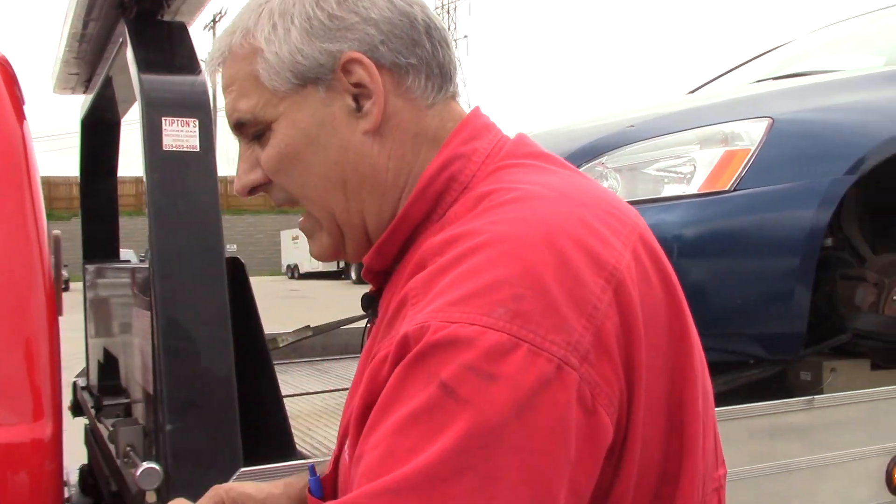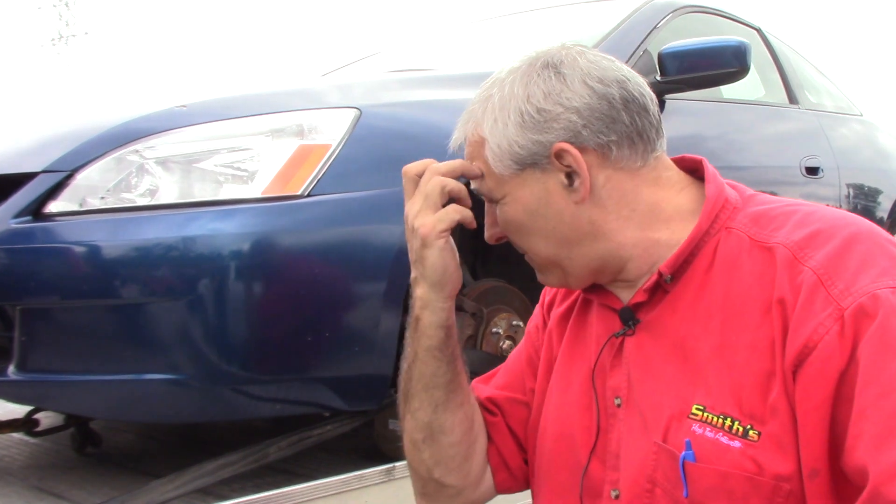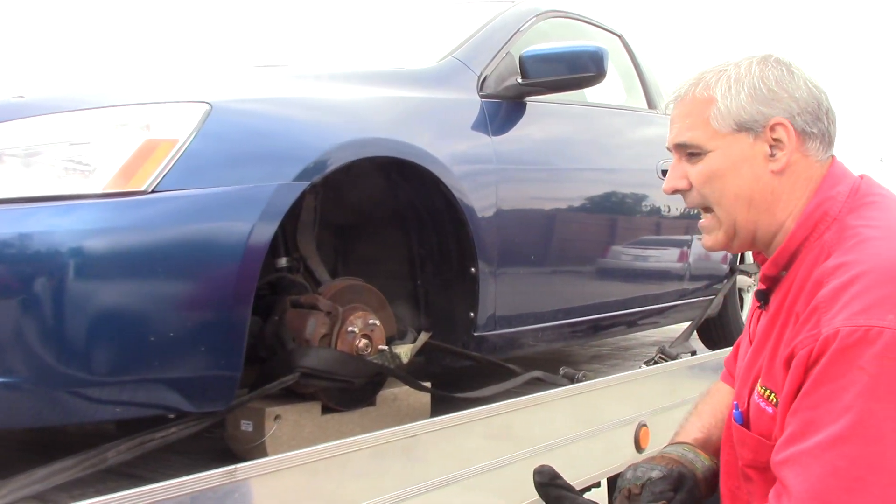Hopefully you get in the habit of listening to your PTO. You can hear it on and off, so you'll know you don't want to ever drive with the PTO in. It'll tear things up, it'll blow transmissions apart. Always listen for that so you know when the PTO is engaged and not engaged.